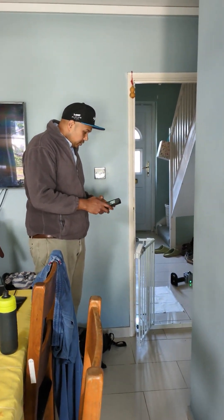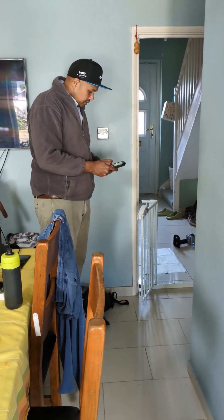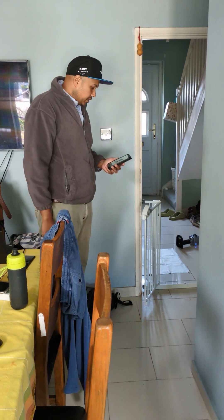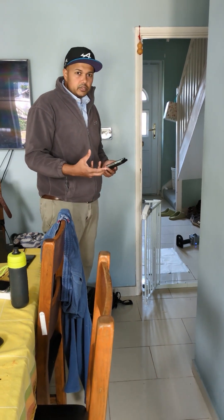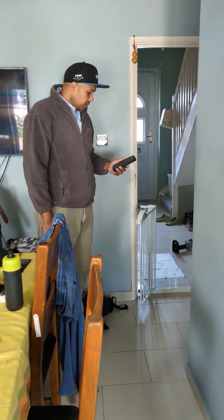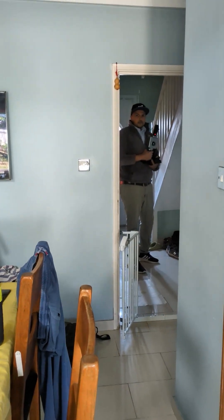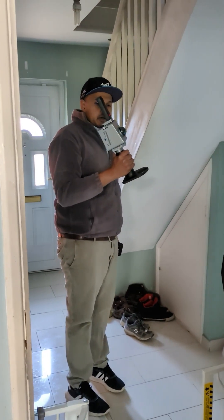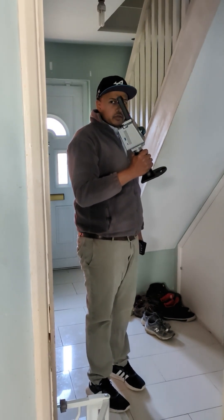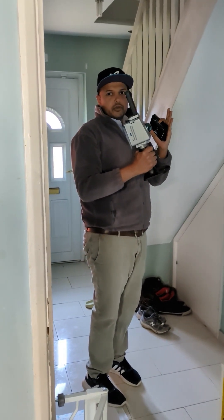Give it a project name and press OK. It will take up to a minute to load up, and it is recommended to leave it on for a couple of seconds so that it gets a good reference of all the rooms in the property. Now it's loaded up, I'll give it a couple more seconds before picking it up. The first thing you want to do is place the angle of the scanner at maybe 30 to 45 degrees and walk around.